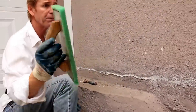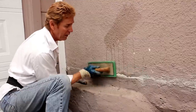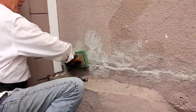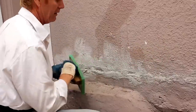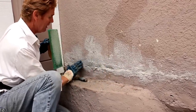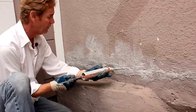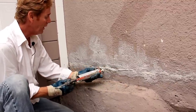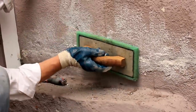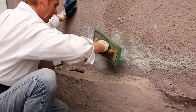If you're not sure, grab a sponge float — they sell these everywhere. This caulk is water clean-up-able, so water won't hurt it. Hit it light and flat, going in circular motions all the way across, and you can get it just as even as using your hand. If you want it even more textured, use the glove. Now, if it shrinks up on you — say I pushed it in too hard right here — just put some more on and try again. Not the end of the world. The float actually brings out the sand in stucco, so it makes sense it brings out the texture in this caulking too.